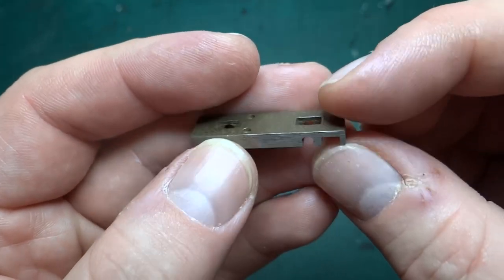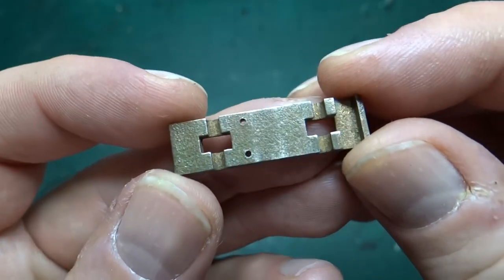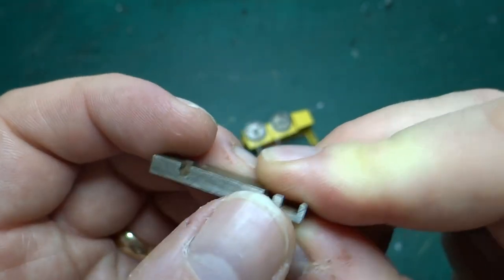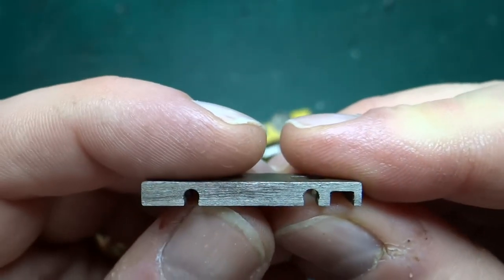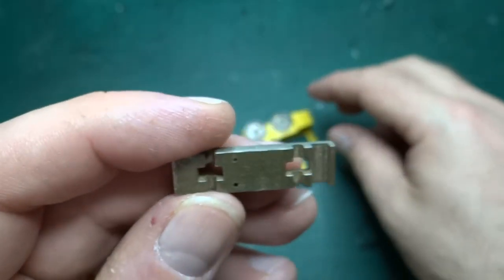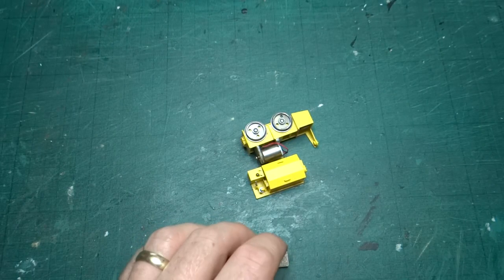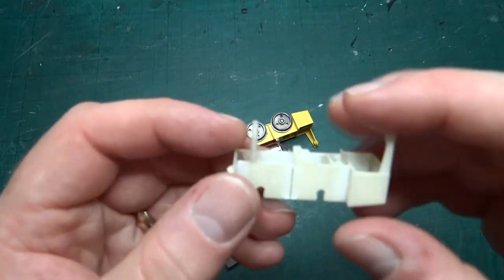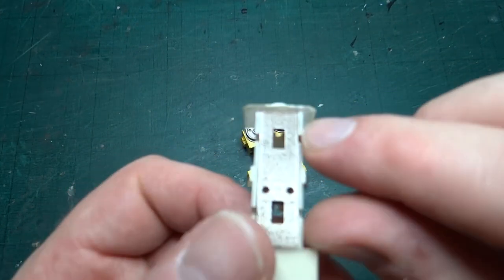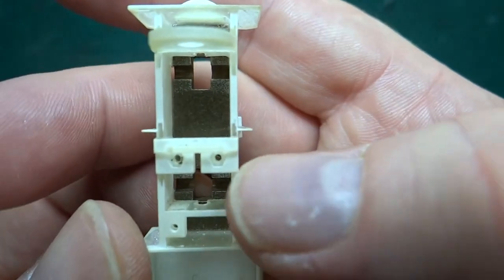If you left it without gluing, the wheel rotating would eventually cause enough vibration for a bearing to move and the wheel would fall out. So I designed a keeper plate that screws in and holds those bearings in place. It's 3D-printed in stainless steel - I used stainless steel because it's the heaviest material Shapeways would print in at the time. The major problem is that it's a pain to work with; filing it is almost impossible with hand tools. It's exceptionally strong. I put two holes in it so it would fit in position.